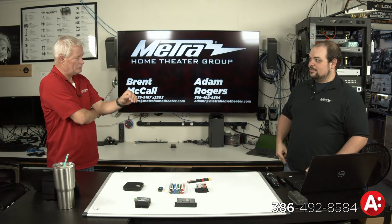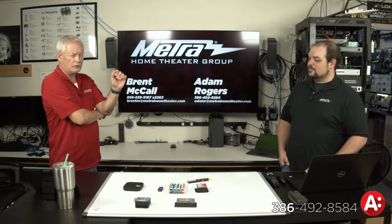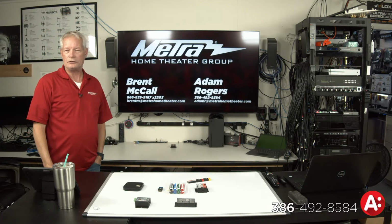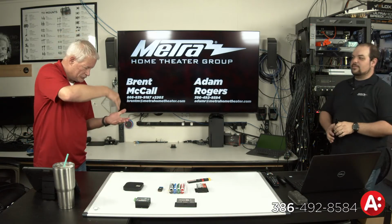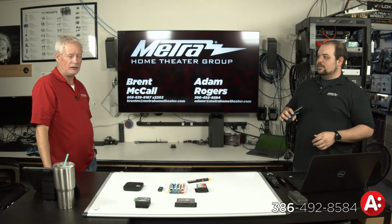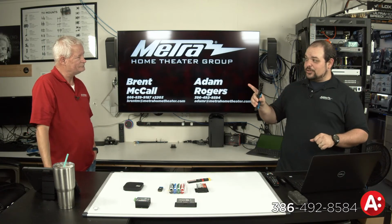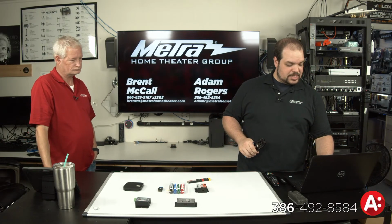Yeah, and actually on that note, a little bit off topic, but not. Let's make a quick tool talk here. On your category crimping tool, make sure your compression blades are new. Because if your tool is dull and out of date, you're not making a good connection by pushing those blades into the wire. And when that happens, you don't get good data. And when you don't get good data, you get fails. So it's not enough to just take it out of the toolbox and go like this a couple times. Honestly, actually take some time to look at it, and we'll flip over here real quick and do a top-down shot so you can see what I mean.